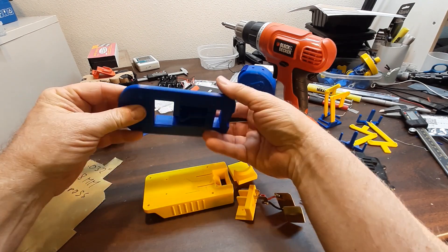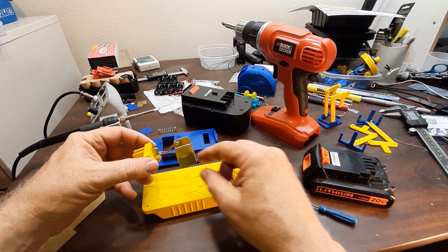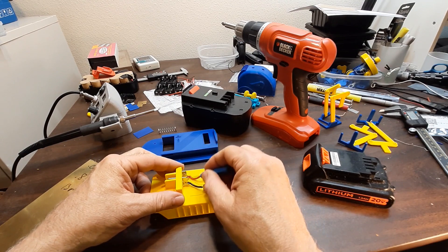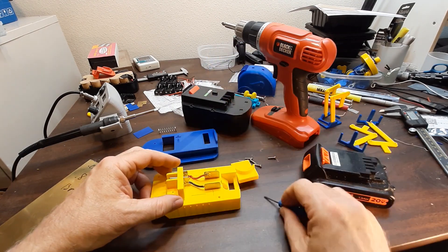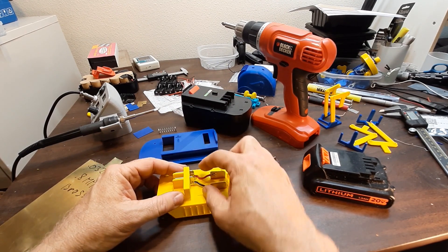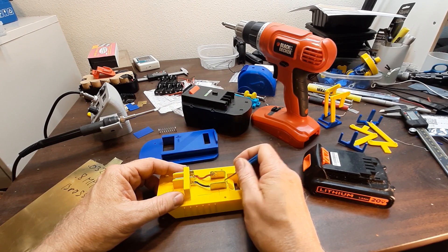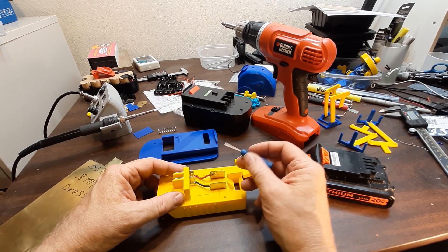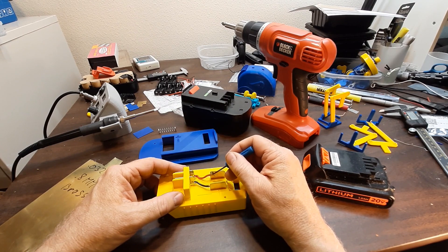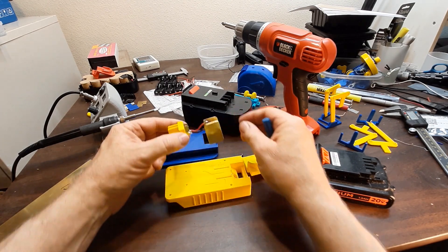If one of those wires broke off and shorted together, that could be a problem. So to assemble it, you cut out these brass pieces and cut your wires to length — these are the original wires that were on this battery. You press these in there and figure out what length you need for the wires. You don't want to solder the wire onto this brass piece while it's in this PLA part, or probably any 3D printed part, because the brass gets real hot and has to absorb a lot of heat for that to solder.